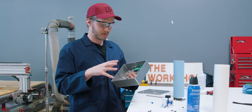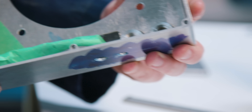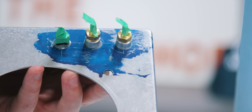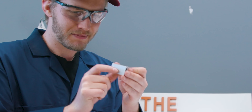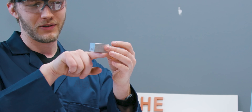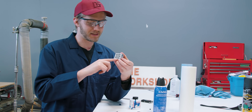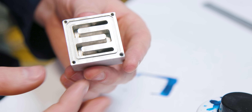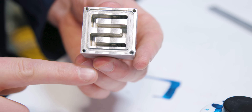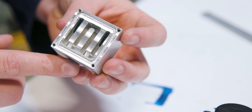The box that all the water cooling bits are going to go into is almost done. We have the fittings made on the lathe, just JB welded in, and some gasket material where the fan header goes through. Everything's taped up because it's going to get a nice coat of black paint. But reviewing the footage, something unfortunate happened — the part moved ever so slightly in the vise because the bottom isn't perfectly flat. So on one side, the O-ring groove is about ten-thousandths of an inch larger than the other side, meaning the O-ring isn't getting crushed there.